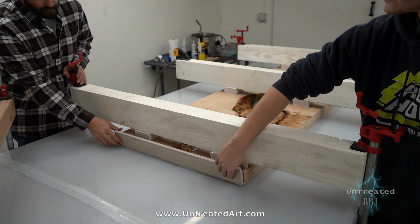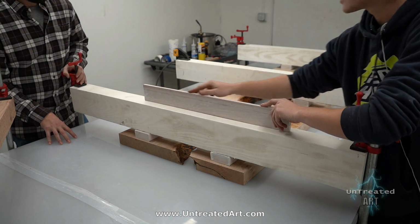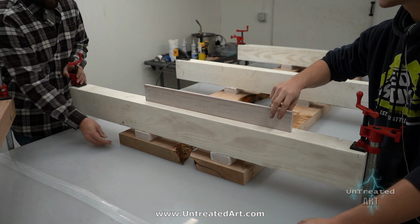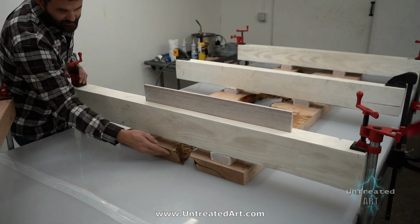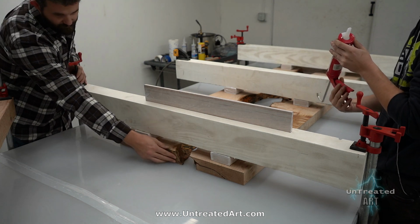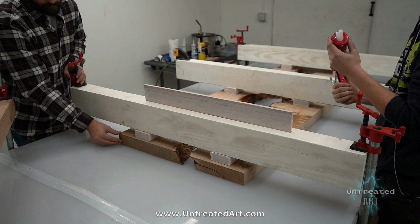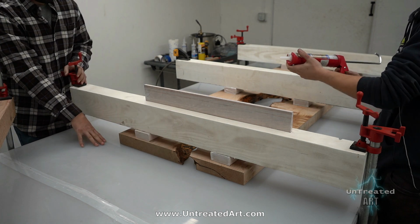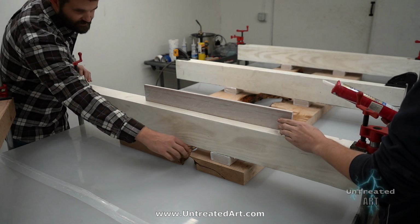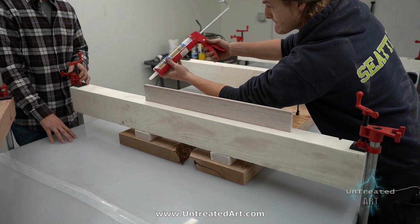Okay, so we're ready to caulk. Put a nice bead along the outside edge here that runs along to the inside so we can press it up against there. There's no epoxy, I mean, a little bit will get in here. We already sealed off these edges. The epoxy we use is very thin, so low viscosity. It will seep into the wood and discolor it, but we sealed this off, which helps prevent that. The silicone caulking will seal the epoxy so it won't come out and it'll hold tight. So let's go ahead and get that bead on there.